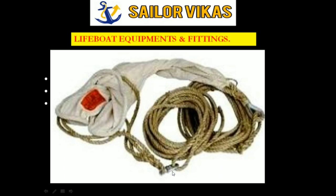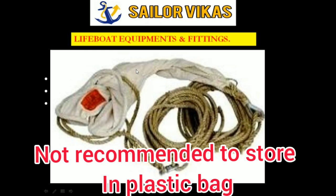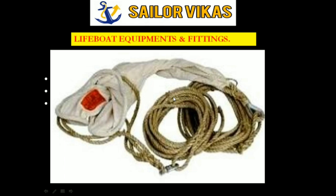So this was about the quarterly inspection for the sea anchor, and it is not recommended to put this inside a garbage bag, because when you go from a cold area to a hot area, some moisture accumulates, and because of that the ropes get damaged. That is what is recommended. So this was about sea anchor.